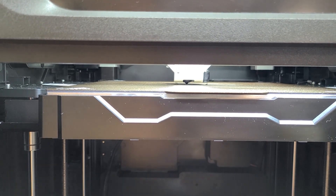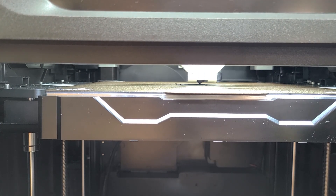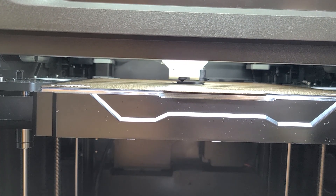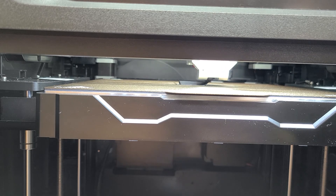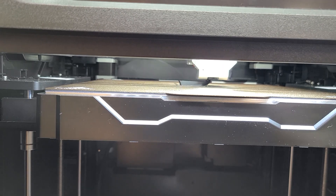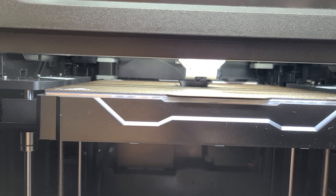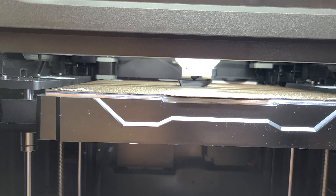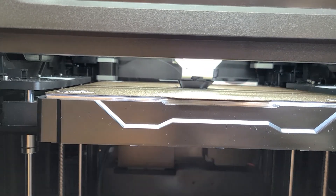Sometimes I'd walk off and it wasn't doing anything. Adhesion was instantly a problem. One of the things they tout this as is having perfect adhesion. I did all the things in the first few runs - cleaning with isopropyl alcohol, cleaning with soap and water, demineralized water, and so on. But they give you a glue stick with it, which to me signals they don't actually expect it to stick. I now use the glue stick all the time - there's absolutely no point in not doing it.